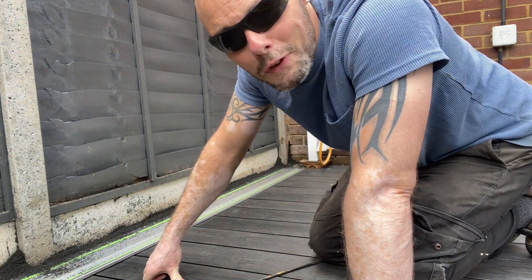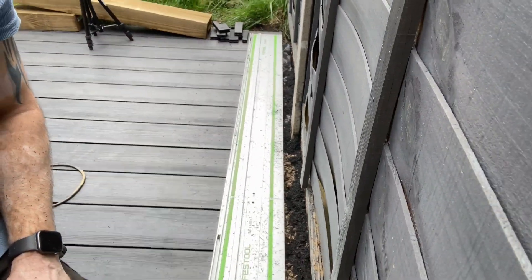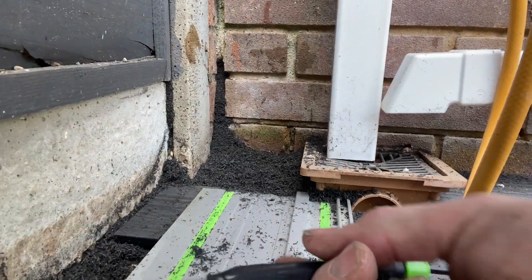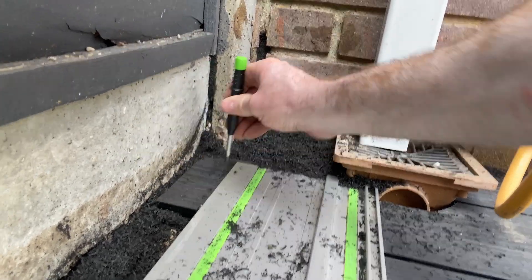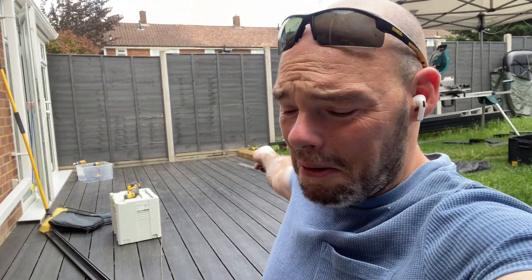Simple as that — and someone's phone rang at the same time! So that's how you get it cut. The offcuts are now pulled out — happy days. For the last bit I can't get the plunge saw around the corner, so all I do is mark a pencil line — it's all perfectly lined up here so I know it's straight — and then grab my jigsaw and just jigsaw that last bit: straight cut, front of line, done. The whole thing is now trimmed and nearly ready for edging.